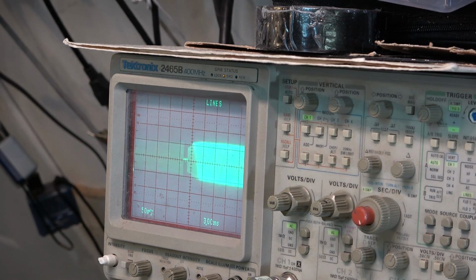The servo's not locking up for starters. I can see that, and the servo light's flashing. So there's a servo problem. Could be capacitors. Could be those surface mounted caps on one of these boards that's full of them. That could certainly be problematic. I'm not seeing anything, just a green screen.